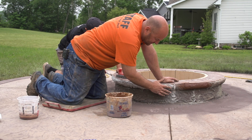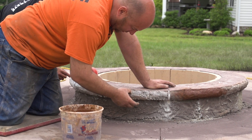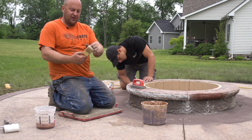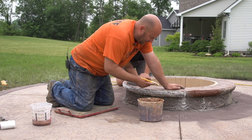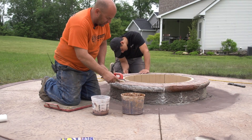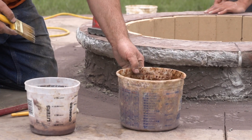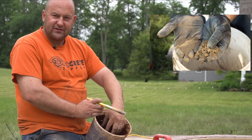With this, we're going to wait until it's just a little bit tacky but not completely dry. If it's really hot out, you don't want to get too much on there — paint the whole thing. You want it just a little bit tacky, but not too wet either. These brushes are really nice for this. Find the finest bristle brush you can find — I like to do them with a two-inch for these noses. We're going to have one to brush it on initially, and then one that doesn't have any color hardener on it that we use for final brushing. I've got my sifted color hardener here that I'm going to paint. If you didn't see the sifted color hardener Technique of the Week, it's number nine — you can watch it right after this to see how we get this mixture.